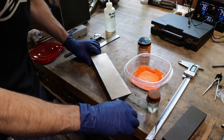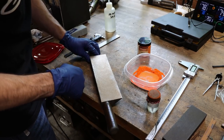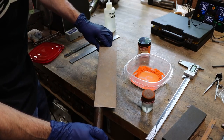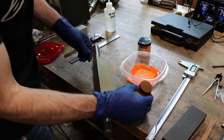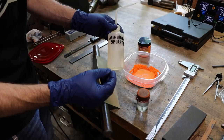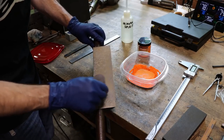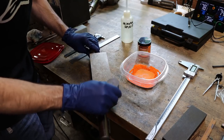Now, there are other alternative methods that are probably safer to use than this, but out of curiosity, I wanted to try the red lead because it historically has been used with scraping for quite some time. So that's what that is. Red lead, little sandwich container, small dauber, little bit of mineral spirits to turn it into a slight paste. The stuff evaporates and eventually you get a really nice super thin coating. And you can almost take this up with the dauber, or press kind of hard.